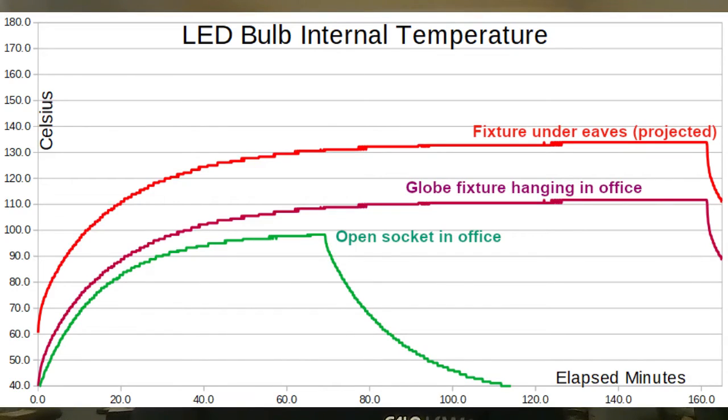You can see that the board temperature never got anywhere near hot enough to start to melt or reflow typical solder used in electronics. I'm being a little charitable toward my theory here using SN62, which has a fairly low melting point. It's much more likely that a lead-free alloy was used in these bulbs, which would have an even higher melting point and even higher process temperatures.